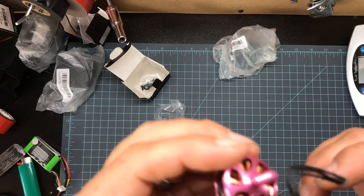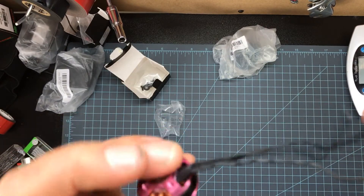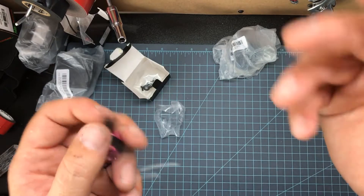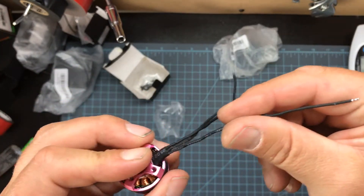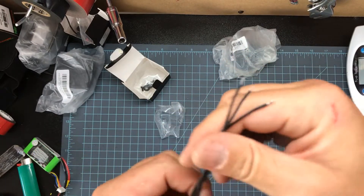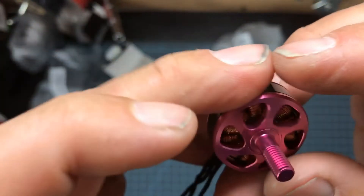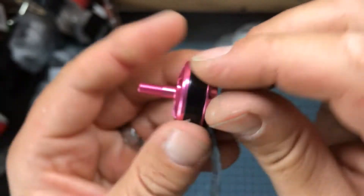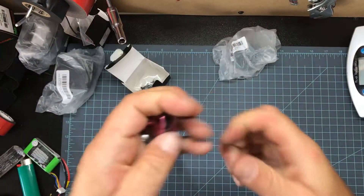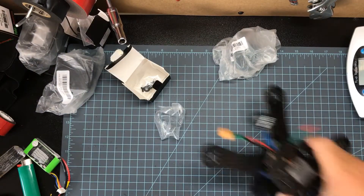The thing that strikes me weird about these motors is the wires. I haven't cut them open yet, but they feel what we call capillary tinned — it's where the whole wire is tinned all the way through. See how it holds its form? It's very craft-wire feeling. The cooling on these looks like it's going to be pretty stellar. They feel good in the magnets but they're not real ratchety, and usually that's indicative of a very good motor, like those gold cobras.